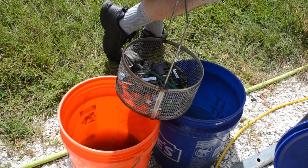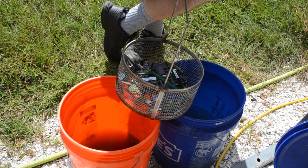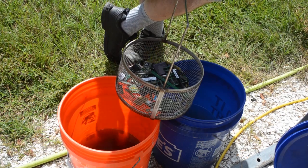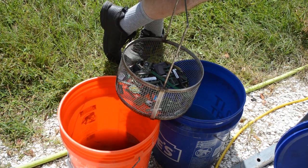That gold was coming off right before my eyes. I'm almost out of high grade stuff, so I'm going to start filling the basket up with the lower grade stuff and use up the rest of the stripping power in the Ecogoldex. Then I can adjust the pH in it and cement out whatever gold it contains.